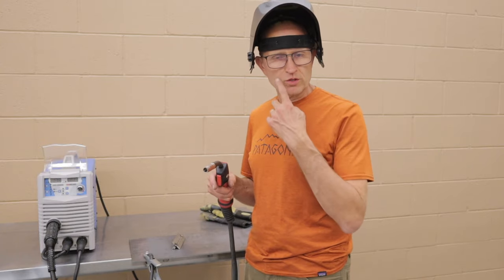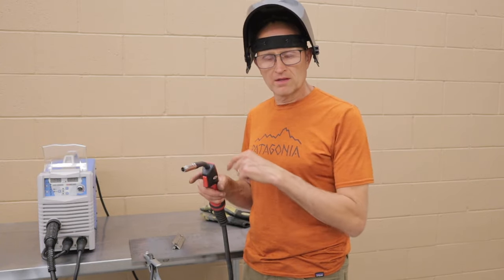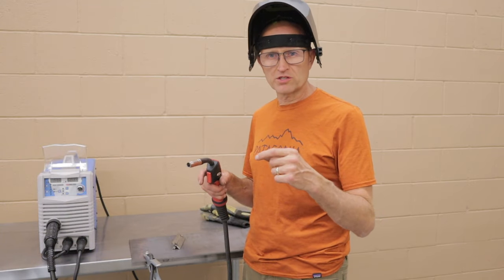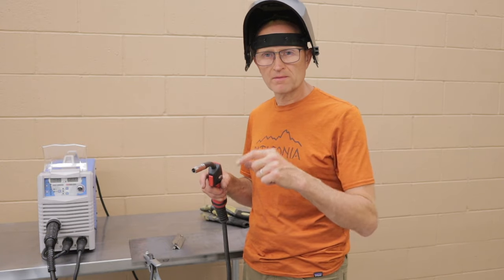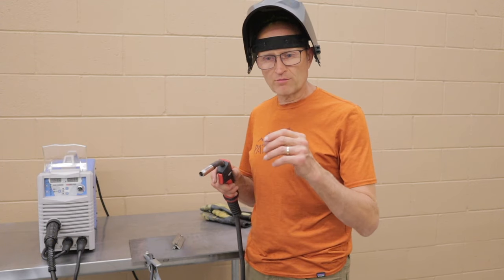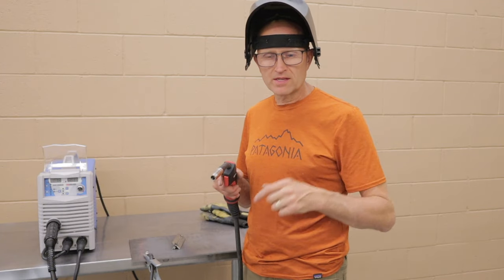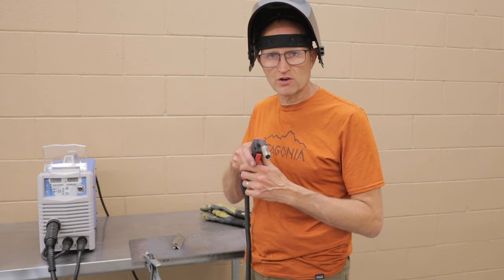The best thing you can do is practice. When you get your welder, take some scrap metal, scribe some lines, usually 1/4 inch to 3/8 inch in thickness or 8 to 9 millimeter wide, and practice running your beads down between those two lines, and practice keeping the weld puddle the same width all the way down. It takes a lot of concentration and a lot of steadiness in your hand.